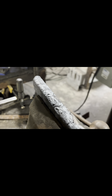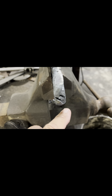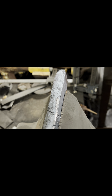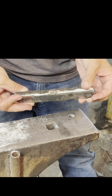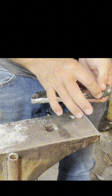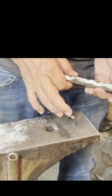I thought I would show some of these cracks. This is not abnormal — it's pretty routine. What I'm going to do is take the angle grinder and come in and grind down any of these cracks, and then reforge it back into billet shape. It looks like a pretty solid piece. You can see where I've ground out all the larger cracks. Now I'm going to put it in the forge and try to make it as evenly thin a billet as I can, and also narrow it down as well.